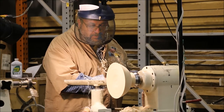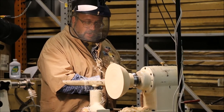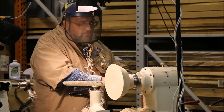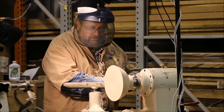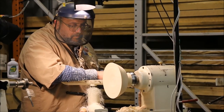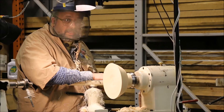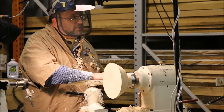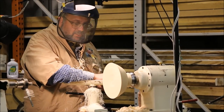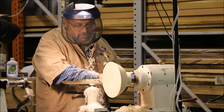There's the shaving coming off. The shaving stopped because I have the angle now too far — I need to pull the angle back a little bit more. When I was coming around here, I didn't bring the back of the gouge around fast enough. So we can just try it again — bring the back of the gouge around faster. Up here at the top, I'm going to flip the cutter all the way up to 90 degrees and go under that rim. The tendency might be to bring it down — if you bring it down like this, you'll make a huge mess. You've got to bring it around and bring it up into this thing. It takes quite a bit of practice.